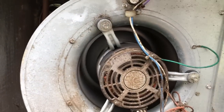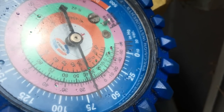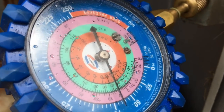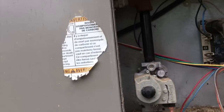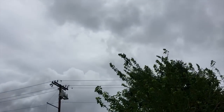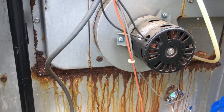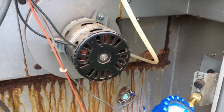I'm going to pop the manifold gauges on there and check the pressure real quick. It's running about 65 — somewhere in that area. It's a mild day, it's rainy, not very hot outside. He said it was cooling fine before this happened, so I'm good with that. Air conditioning is running, this looks a lot better than what it did, but we're definitely going to have to put him back on the schedule to check the heat exchanger — I'll have to pull the top off this unit. He needed his air conditioning, so we got it back on and we're going to schedule him for a heat exchanger inspection before he sells the house.